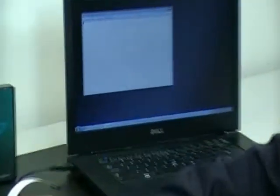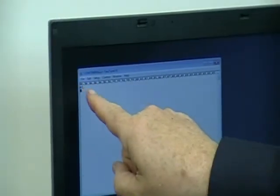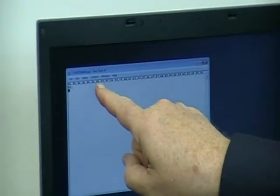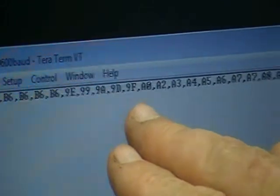At this point I'll press this button to dump the data out. As you can see, we've got a series of hex bytes coming out that each represent the upper eight bits of the 10-bit ADC converter value that was logged in flash memory. You can see high numbers indicating high temperature, then it went down when we hit it with the cold temperature, and came back up.